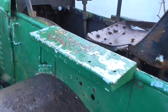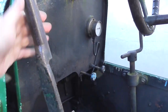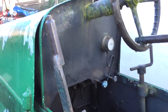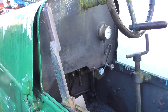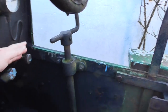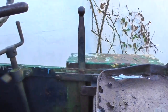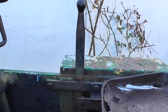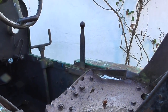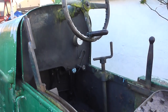There's a fair bit of work to do on it, but these are the basic controls. This lever here is your forward/reverse clutch lever. This is the stop, this is the throttle. You've got to have this in forward direction and the high/low gear in neutral, which is straight up — then you're configured ready to start the machine.